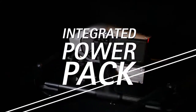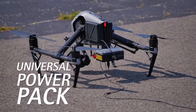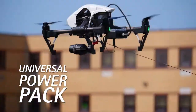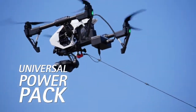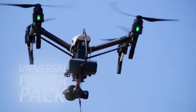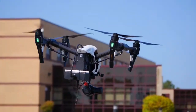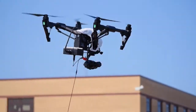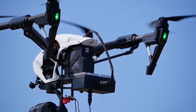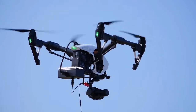Powerline offers the integrated power pack for use on the Inspire 2 only, or the universal pack that mounts to the airframe rear, allowing the Powerline tethered system to work on the Inspire 1, Inspire 2, and M200 series drones. A special underbelly bracket is added at the center of gravity to keep the tether load balanced and free of rotating propellers. Locating the tether at this mounting point keeps the rear motors running inside the design spec. No permanent modification to the drone is required.